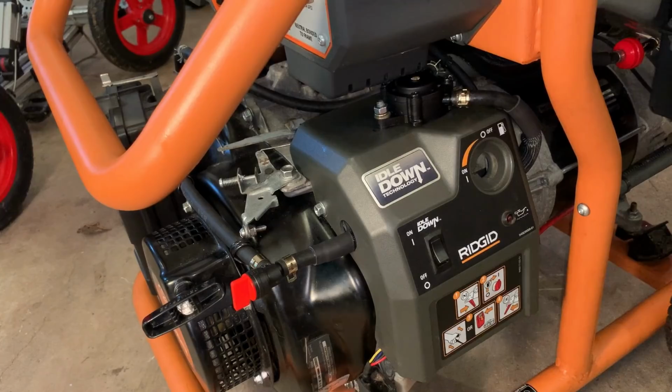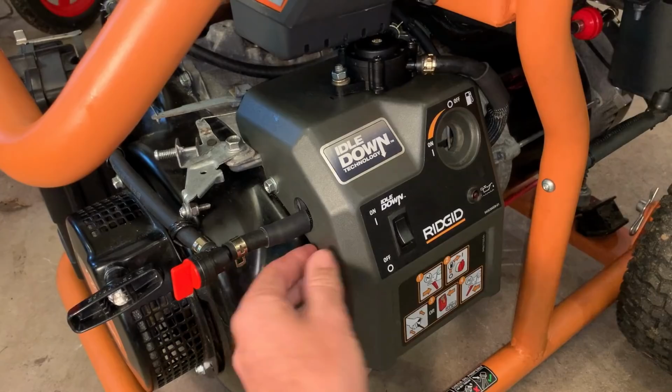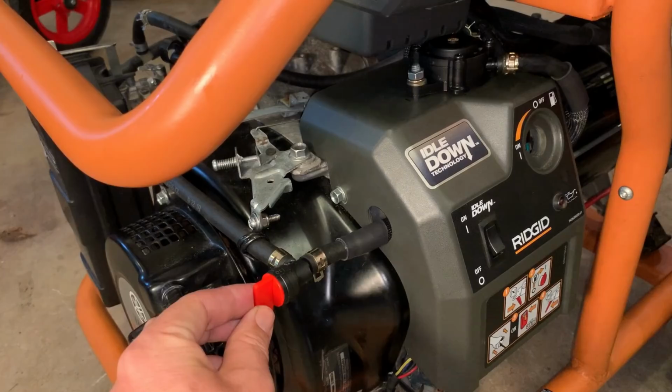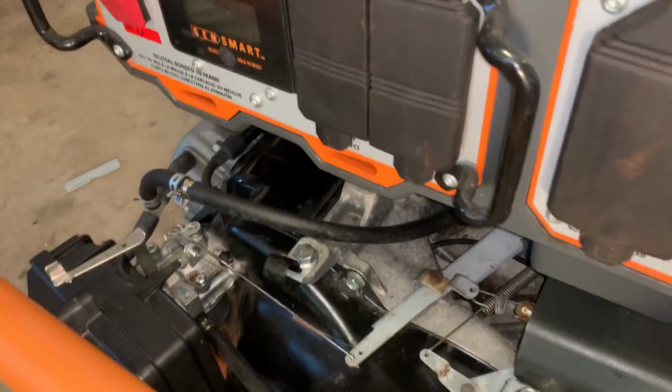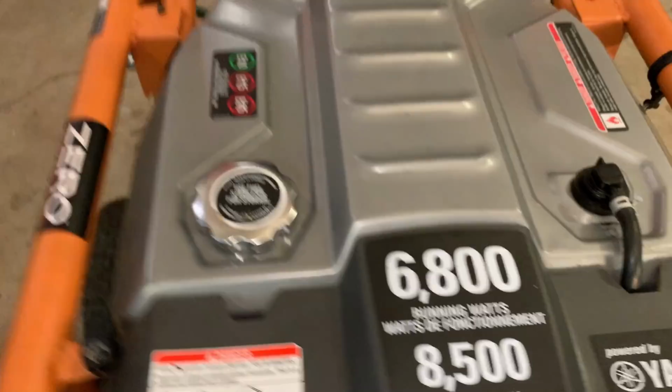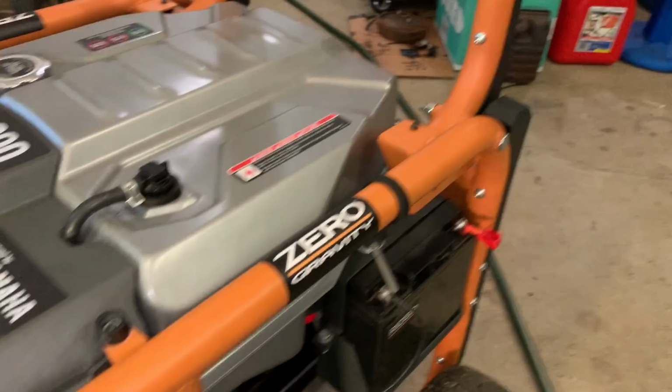And this line here still goes through and then wraps up. I did insulate it partially for heat and also to add some additional abrasion resistance. Now I kept with the original Subaru and the older Yamaha design. I left the fuel valve up here, secured this line in with two clamps, and the vacuum line is also finalized. So this thing is pretty much done. I think the only thing left is really just to get a barbed fitting and extend the vent over to the airbox. But you know, this video's gotten quite long, so I'm gonna call it at this point.